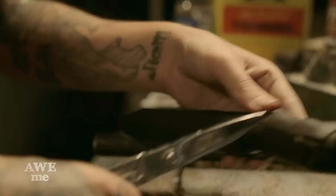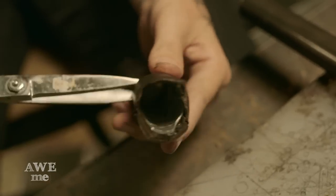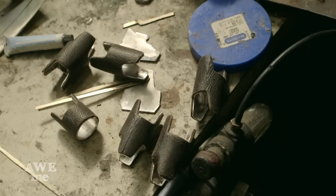I'm going to cut out chevron shapes in thin-walled aluminum tubing that will stagger down over the one-inch steel tube. Those will be covered with leather, and then there will be nickel silver spacings between them.